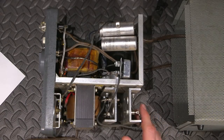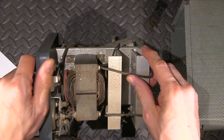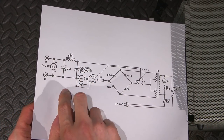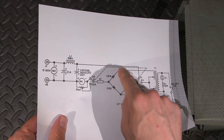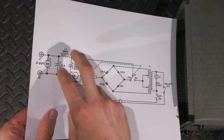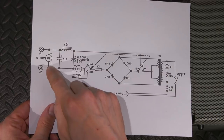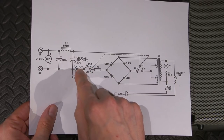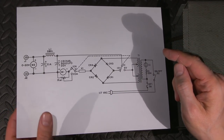From the rectifier it runs through a 5 millihenry choke here - L1 - which is this nice big coil, probably wound with number 10 wire. We have a capacitor on one side of it on the bridge rectifier side, and another capacitor on the other side - so we have a typical pi network type filter. Then we have a voltmeter across it reading 0 to 20 volts, and the current meter is in line with the load. Now here's where it gets clever - there's a ganged switch, indicated by the dotted line.